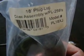I used an 18-foot chunk of RG58 coax with a soldered end on it. Don't use the crimp molded ends — the soldered end is a better way to go.